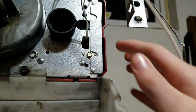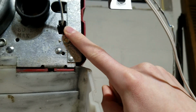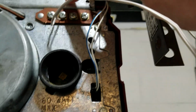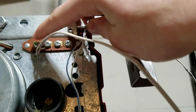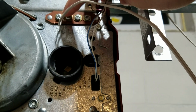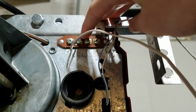When I have this light cover off here, I'm also real quick going to go over the wiring on this operator. So right here, this plug in the front is where you're going to plug in the wire that runs to your safety sensors. Up here you have 4 screw terminals. It's for the wall-mounted controller. Terminal 1 here is your common. Terminal 2 is open-close. So shorting terminal 1 and 2 will run the door.